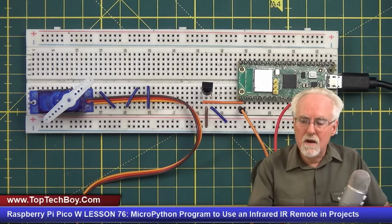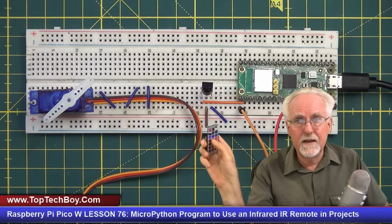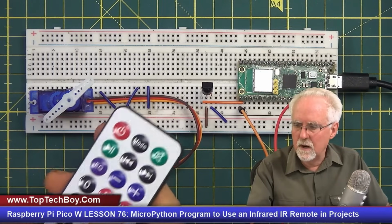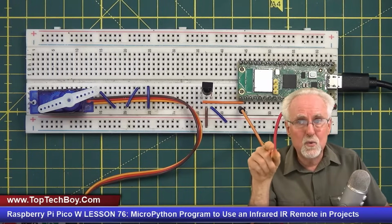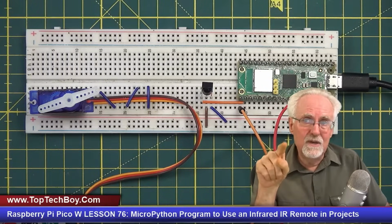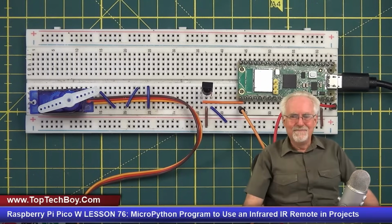So you see I'm ignoring the nonsense. Also notice that I'm not deliberately doing short button pushes to avoid the negative one. The software avoids the negative one for long button pushes. I could do star and then 22, and it will recognize that because it's ignoring the minus ones. A two, let up, a two would be like 2, negative 1, negative 1, negative 1, and a 2, and it works for that. So you can get repetitive button pushes, but the long button push doesn't hurt you.